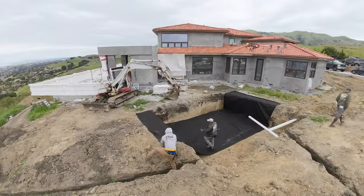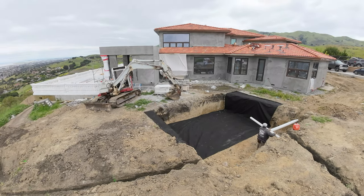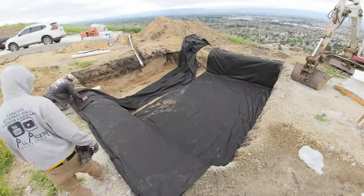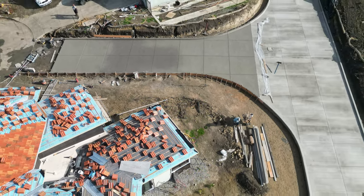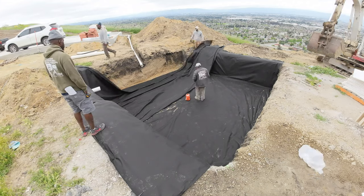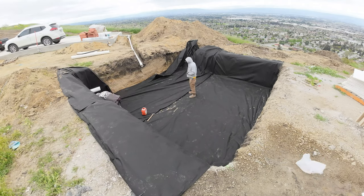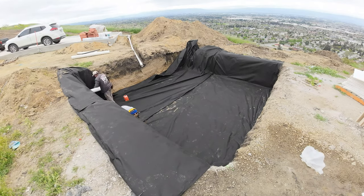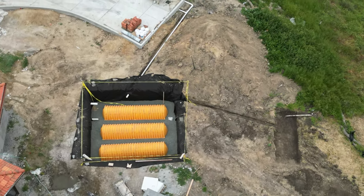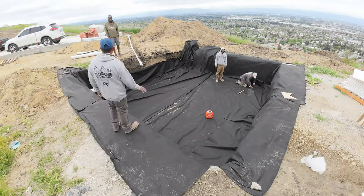I want to jump in here — this was supposed to be two videos; I ended up making it one. The first part explains what we're doing here, which is installing the biodetention. This biodetention is going to capture all the runoff from the driveway — that's a 100-yard pour; I'll leave a link below. The water comes in, soaks into the earth. If it's a 100-year rainfall, which this was designed for, it'll come up into the chambers and discharge in the back into a smaller biodetention.